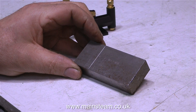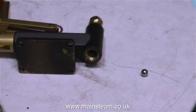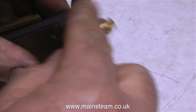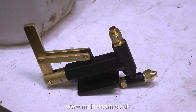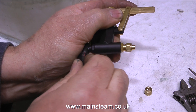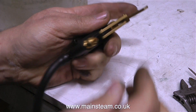I'm going to cut this block and mount this hand pump on the block itself, using my horizontal metal cutting bandsaw. This hand pump has a ram which is half an inch in diameter, which means it will move more water. But the problem is this kind of hand pump is designed to be immersed in water in the back of a tender, or fitted in the side tank of a model steam locomotive. To make it work in my application, I have to mount it on a block and use a right angle steam fitting to pipe it up.